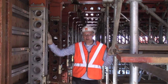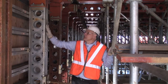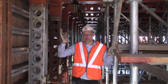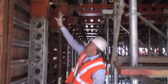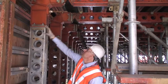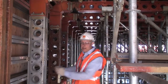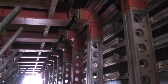In order that the tunnel segment can be physically lifted off the falsework and formwork, the internal formwork to these walls here has to be capable of being hinged backwards. In order to do that, RMD Quickform engineers have come up with a special unit up here which enables not only the chamfer to be cast in the side of the tunnel, but also, once the formwork ties have been removed, the whole of this formwork section to be hinged in to create clearance so that the tunnel segment can be lifted and slid off the top of the falsework.